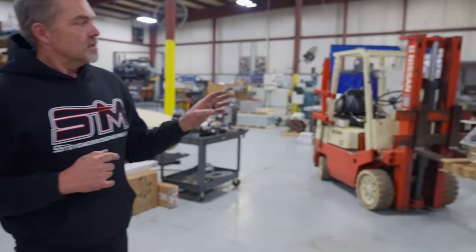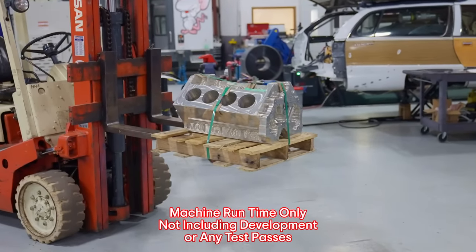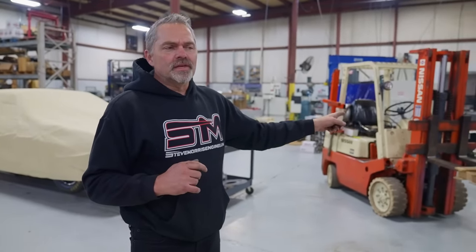So here you're gonna start seeing the full second step, which is basically finishing off the block to the point of putting it probably into the centroid to do more finishing. I think so far in straight out machine time hours, Brock could correct me, there's probably 10 to 15 hours to get the block of material to that. So 530 pounds worth of chips took 10 to 15 hours.